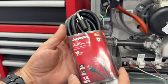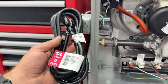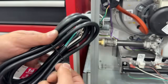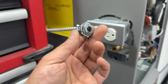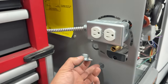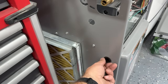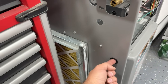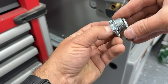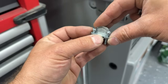Next, let's move on to our pigtail. This is a 14-gauge pigtail rated for 15 amps, which is what your traditional gas furnace is rated for — make sure you don't get a 16-gauge or anything higher. This strain relief fitting here keeps the cable from vibrating against the cabinet case — you could also use a rubber grommet. It fastens with a nut that sandwiches and clamps down on the pigtail to keep it nice and secure from moving.